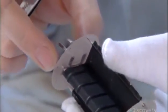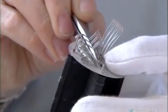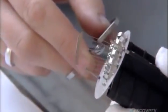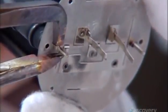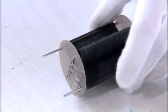The anode's top-secret black coating increases the effect of the electrons hitting it, causing the anode and cathode to have two different voltages, both of which are greater than that of the original signal. This makes the signal larger and more powerful, meaning it amplifies the sound. With those three key components now assembled into one unit, the inside structure of the tube is complete.